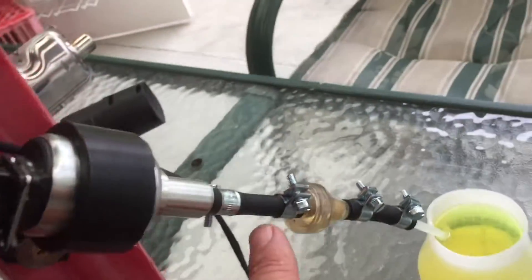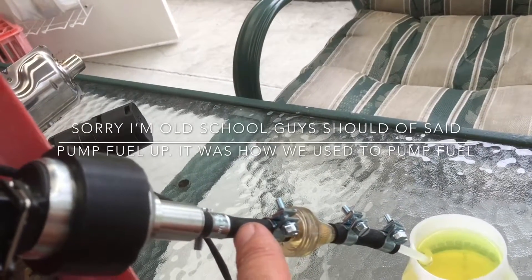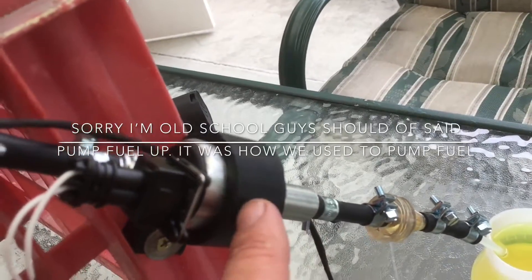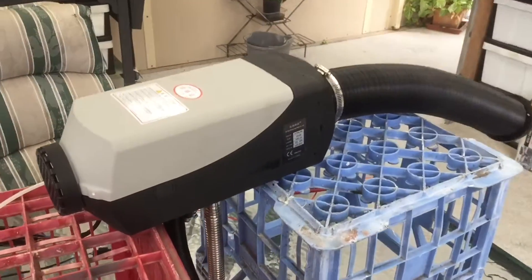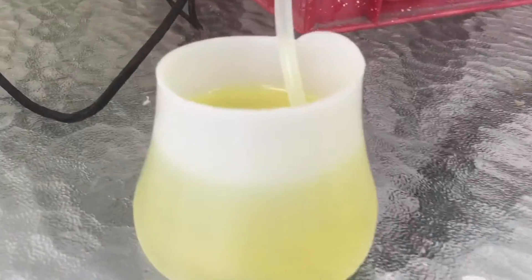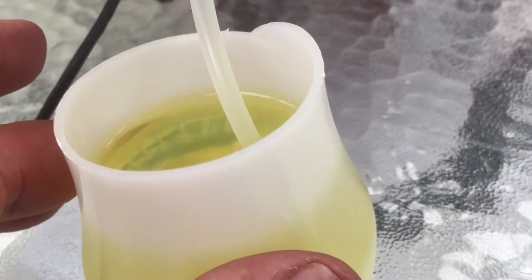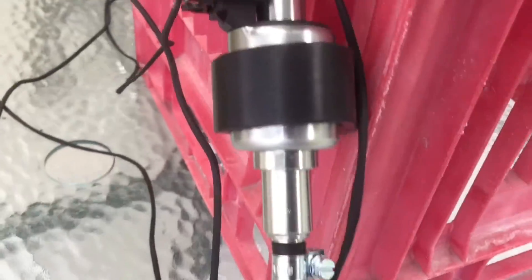She's starting to fire up now, the fuel's just going through. You can't run these pumps dry - make sure you suck the fuel up. Just get your mouth and suck it through. Don't run this dry for too long. I think she's firing up now, I can hear it. Okay guys, she's in full action now. Here it is - the fuel's coming through, she's sucking the fuel up, from the fuel filter up through the pump.